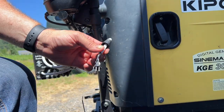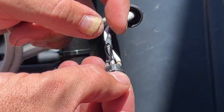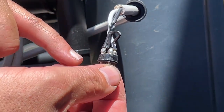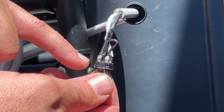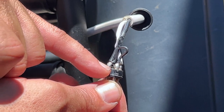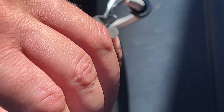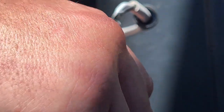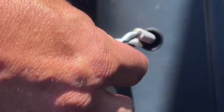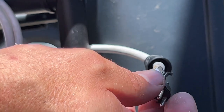Okay, so let me zoom in. Different charger manufacturers do this differently, but see this little wire right here? That is what triggers the inhibit on the chair. Some chargers will just have a little solid piece of metal soldered across there. This one just has a little wire. So all we gotta do is clip this. There we go. Fold that up straight. And that's basically it. Now we can plug it in and the thing will still move while it's charging.